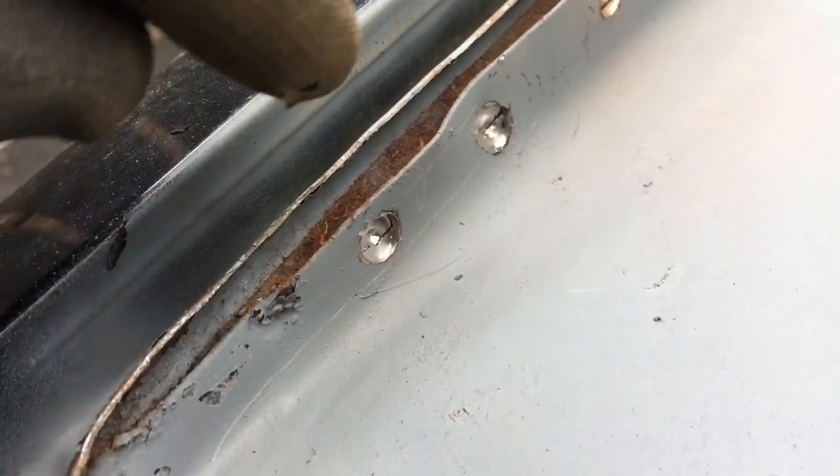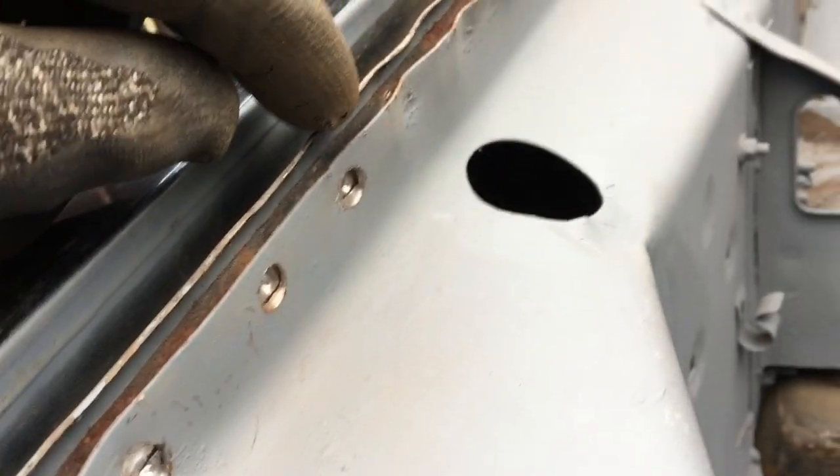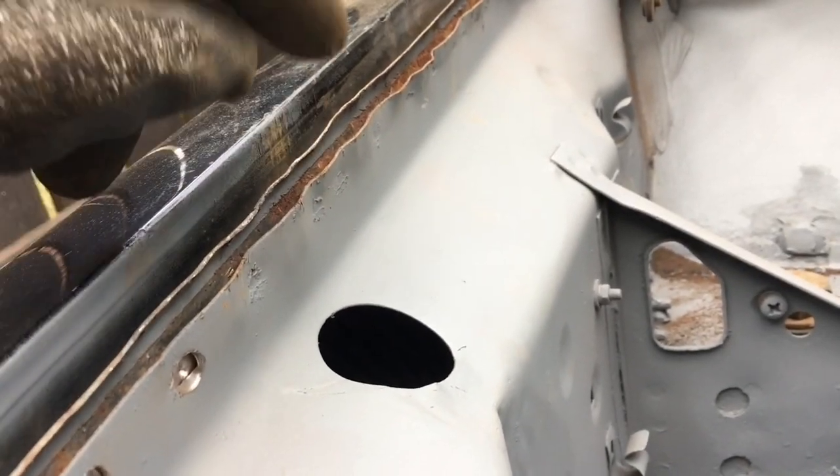That's one thing I struggle with sometimes with cars, because the spot welds are so well hidden, you can't often see them. So you could be sitting there all day trying to find where to drill out. But by doing this, look, you can see very easily how pronounced they all look. That's just a little tip from me if you guys struggle with that. And again, they're barely held on with anything down there. So, like I say, we're nearly off.